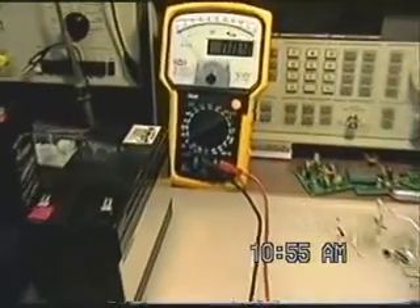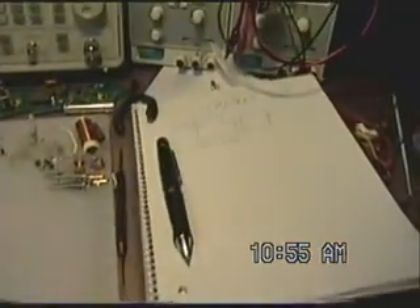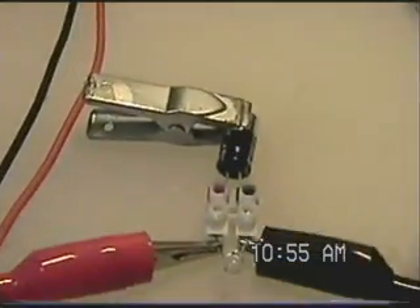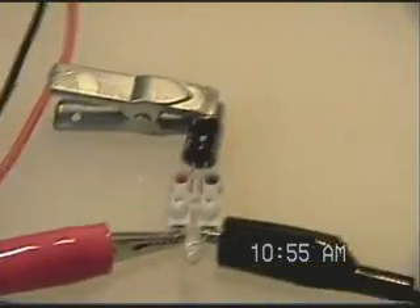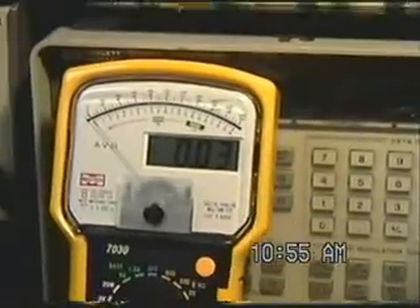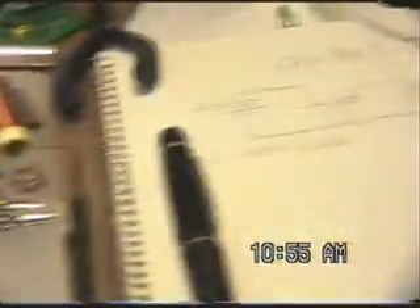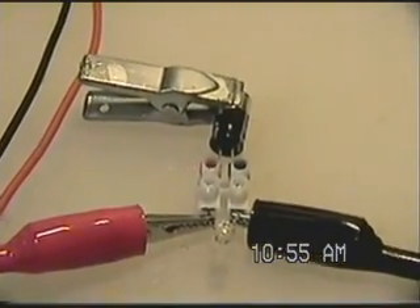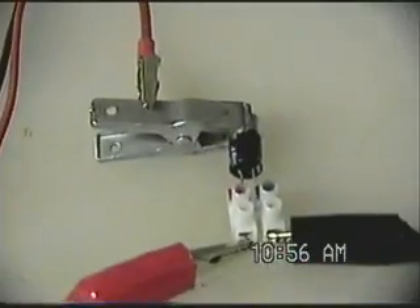I'm going to be using a combination digital-analog meter, and I've got a lead acid battery that measures right now at 12.33 volts. I'm measuring any start voltage that might be on this capacitor even though it was shorted — as we know, electrolytic capacitors have a tendency to recover some voltage. The meter is reading 0.03 volts. I'll go ahead and make our connections as per the diagram. I'll be using a super white LED which requires 3.6 to 3.7 volts to begin lighting. I have the positive terminal of the battery connected to the shell of the capacitor.